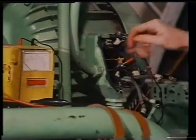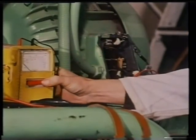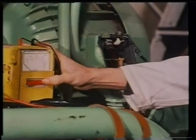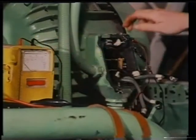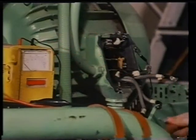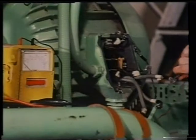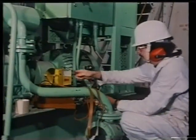The phase windings have been separated electrically from all other parts of the motor. They can be tested separately to earth. We've now tested each and every separate electrical component in the circuit on the load side of the starter. These techniques, in some combination, will be used to trace an evasive fault.